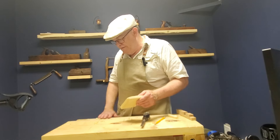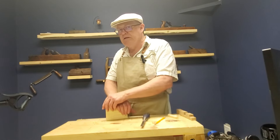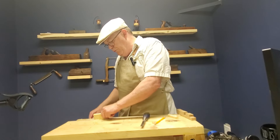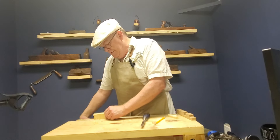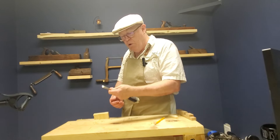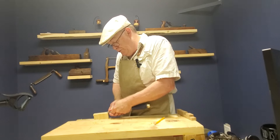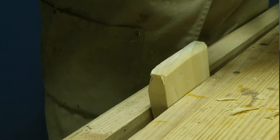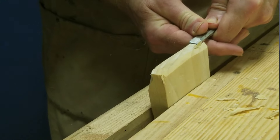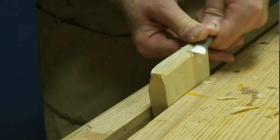He specifically doesn't say that you should mount this in the vise — the book says you're supposed to hold it — but that seems a little sketchy to me. I've just seen too many injuries. So if you can, get it into the vise, and then you actually have the ability to come in holding it by the blade rather than by the handle and do small strokes, registering the back of the chisel against the work and coming in. You can almost do a slicing motion — more like paring in the kitchen.